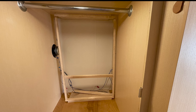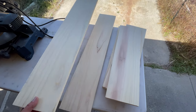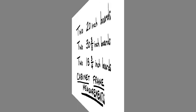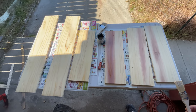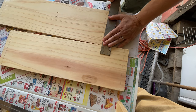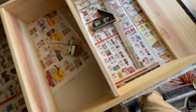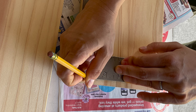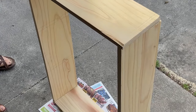In this image you can see how we used our remaining one and a quarter inch redwood strip to build a dummy frame and test our measurements. We just cut the wood into the sides of the shelf and the shelves — four pieces total: bottom, top, and two in the middle. Right now we're treating the wood. Here we are getting ready to do our pilot holes before we put the shelf together. We're putting the top on and just making this square.